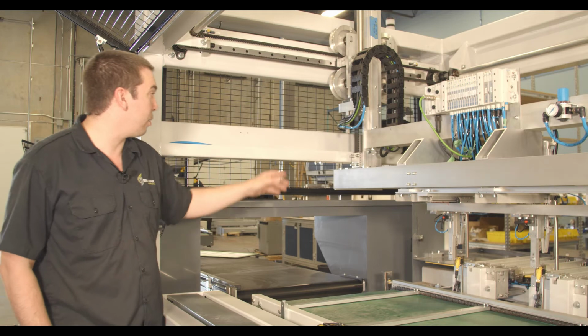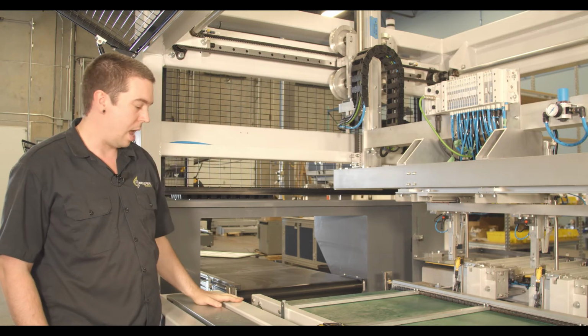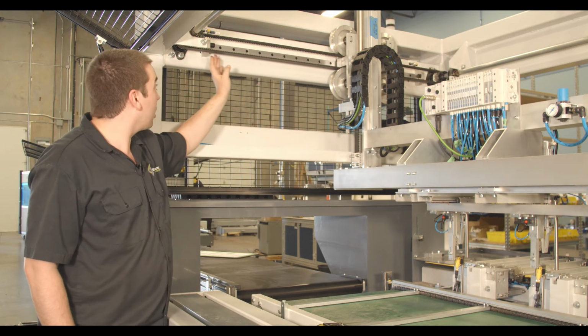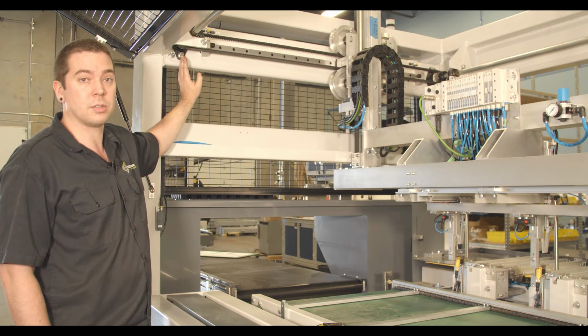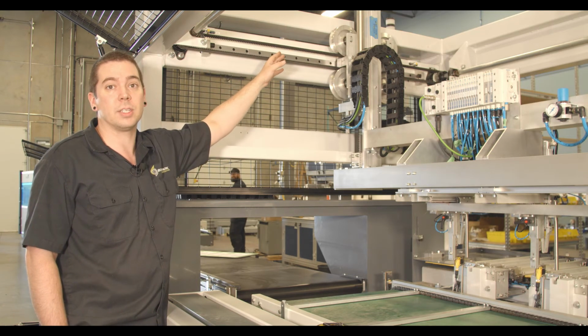After doing this, you can replace the belt back through the pulley system. Put your belt clamp back in place. Then you're going to want to measure from the center of your pulley to the center of the bolt, 750 millimeters. And after doing that, you can proceed to tension your belt again.